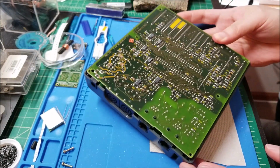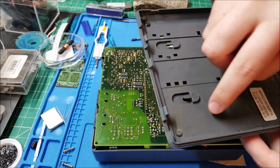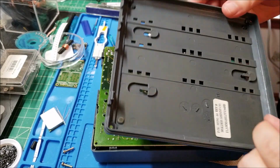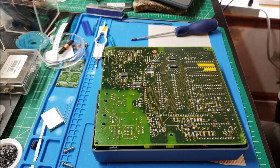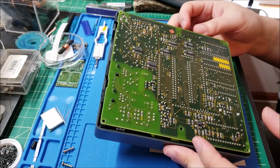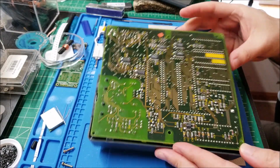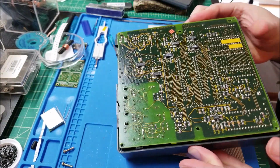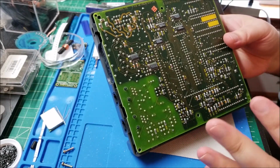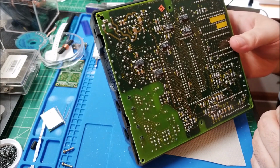And we're right in. And interestingly enough, I don't see any, in some newer devices, it'll actually be a flat flex mesh that's printed on the plastic, where just opening the device will break one of the traces, or if you try to drill in to avoid unscrewing it. And usually there's a switch that's held down by the lid, so when you go to open it, it'll erase. I don't see any security mechanism so far, which is rather surprising. But yeah, the layout looks like a lot of through holes, some surface mount. So I think this does place it around mid to late 90s.